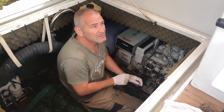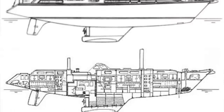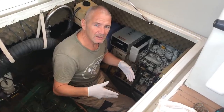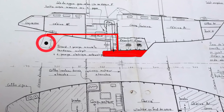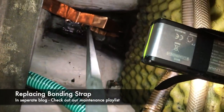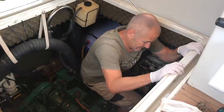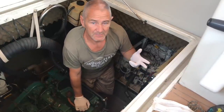Right, so today is our favourite maintenance job ever, isn't it Whiddy? We just serviced the bilge pump and we've got some of the pipes out anyway, so we thought we might as well carry on and get the rest of the pipes out. There is one main bilge where all the water goes into, and obviously because of all the stuff that goes in there it does get quite disgusting — it builds up soap suds and all sorts. The black water goes into its own tank. There's also the bonding strap which connects the steel bulb on the bottom of the keel to the rest of the bonding system, so that needs checking as well. Last time we checked it was broken, so we replaced it — I just want to give that a check. So we can tick off a few jobs by doing this: clearing out, checking the bonding strap, servicing the bilge pump, and cleaning the bilge.